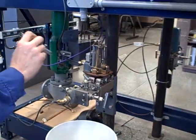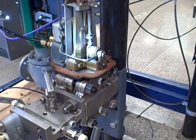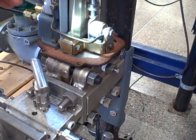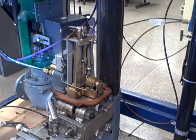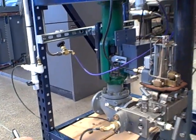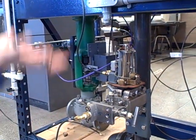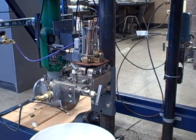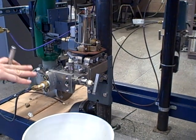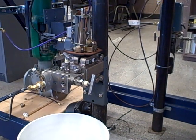The way we do this is we use the zero screw. The zero screw is what shifts the zero calibration of the transmitter, and the way it works in this particular design is a screw that engages with the spring and pushes at the bottom of that range bar. If we have a suppression setup — a height difference between our tank and our transmitter — when the liquid level in the process vessel is at the 0% mark, we already have a pressure on here. We need to back out the zero adjustment to suppress the zero so that even with that initial pressure on the transmitter, it's going to say that's our 0% mark — we're just getting started with 3 PSI.